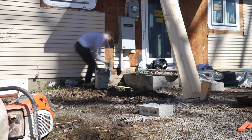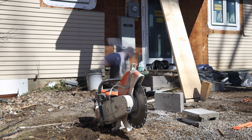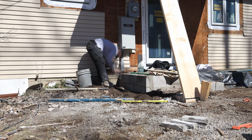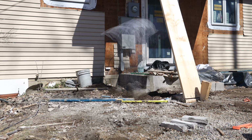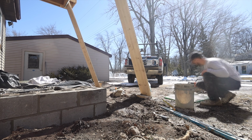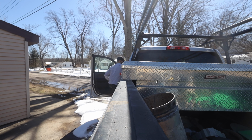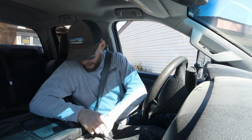It's still not really bearing that much weight because the roof is cantilevered into the house, so the posts are kind of just decorative, but there's still some weight, and over the years, it might sag. So I didn't want to just pack it out with cultured stone. I wanted something solid. Already got the block laid.